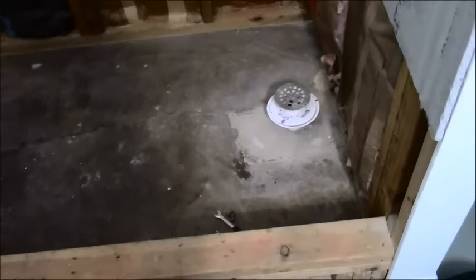And as I said before, I'll clear out some of this stuff, put a 45 on there, which will get it straight. Then I can run a line of inch and a half pipe over to this area, put a 90 inch and a half going up, and then a short piece of inch and a half, which is going to look something like this. This is a bushing, which is what he had originally put in there, which I cut out. So this is one I've had in my truck for a while.